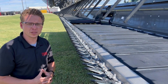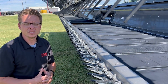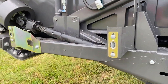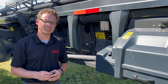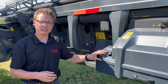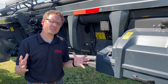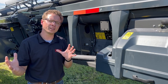Two different sickles are available: the standard AGCO guard and the SCH guard, both available in small grain and row crop configurations. The operator can order a spare sickle to be stored on the header for easy access. All widths of DynaFlex headers use a dual sickle drive configuration with Schumacher gearboxes and an integrated flywheel to maintain the quality of cut. When connecting the header, it's important to make sure each drive is timed. This is made easy by a letter wheel installed on the header end of each drive line — make sure the same letter appears in the window on each side of the header. If the sickle requires timing, position each sickle at the outermost position of its stroke, then adjust the letter wheel to show the same letter on both the left-hand and right-hand side drives.